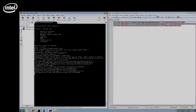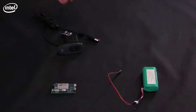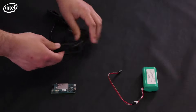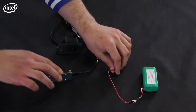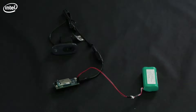It has downloaded everything, so your Edison is now up to date and ready for this tutorial. Now we're going to connect the webcam to the Intel Edison. For that we're going to use the USB OTG cable. Connect to the bottom port, then plug in the Edison — being very careful with the polarities. And voilà! The LED becomes green, which means everything works.